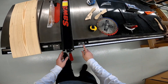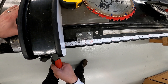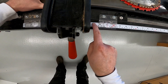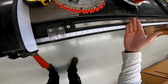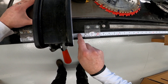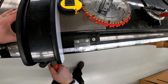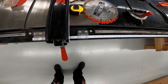Next, we're going to set the fence. We're going to make our first cut at 11 and 1/8. Now this ruler is in 32nds up to the first foot — those tiny little lines are 32nds. To make things extra confusing, after a foot, this ruler simplifies and goes to sixteenths. And this gauge is zoomed in and bubbled, so a very common mistake is people accidentally set it to 11 sixteenths, thinking one sixteenth, two sixteenths equals an eighth, but that's actually 32nds. So we will go to 11 and 1/8.